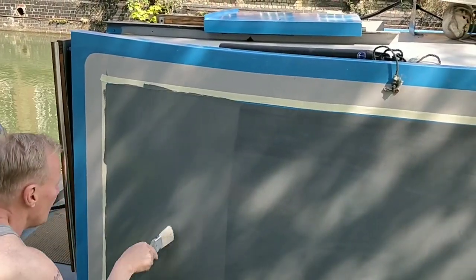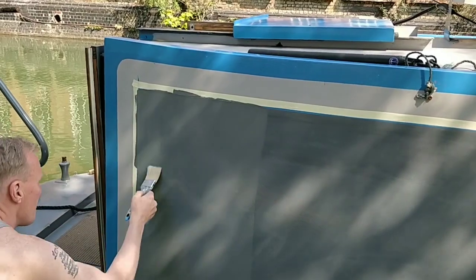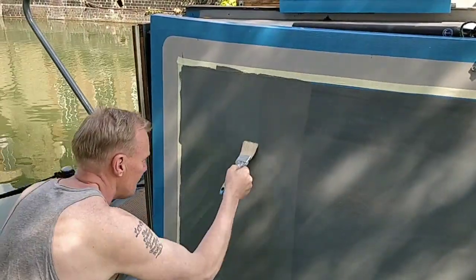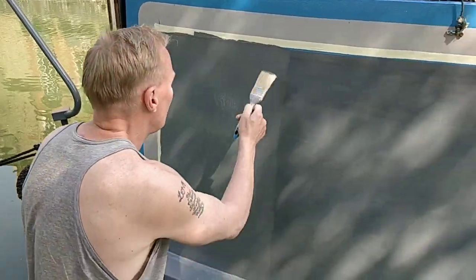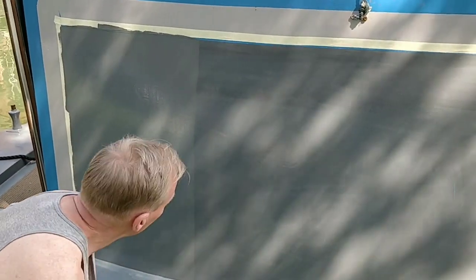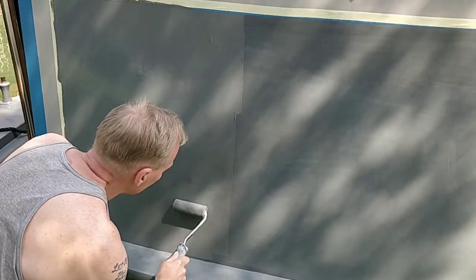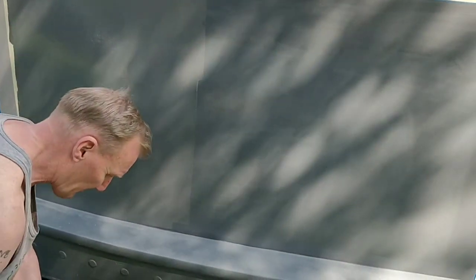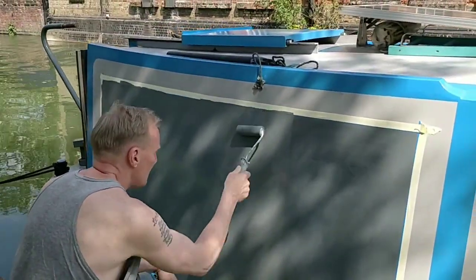If you leave it too long it will get too sticky. Just getting that bit there — obviously I can lay it off again, all the way down. Another important thing: once you start, you can't wander off and get a cup of tea. If you just left that edge you'd come back and it'd be hard with a big line in it, so you've got to keep going once you start. It's also important to blend your last bit — even though you've just laid it off, go over it again so you don't get a line. Just to blend those two sections in.